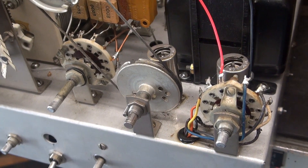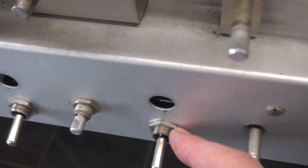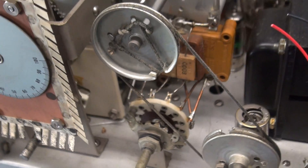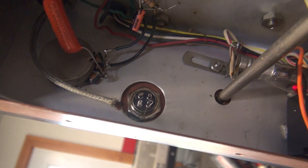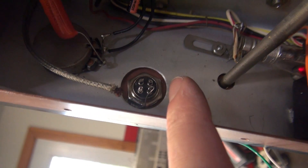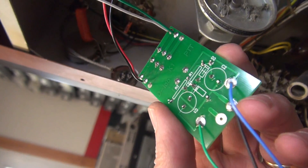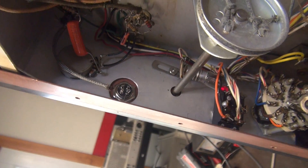Before we put the front panel back on, as promised, I have new meter leads installed and some jam nuts on those switches. Everything's cleaned and lubed - time to put it back together. Hard parts are out of the way. Here's the back side of the new mic jack and you can see there's plenty of clearance to do the wiring. Next step: put the K1 module down here on the chassis and start the wiring.